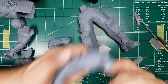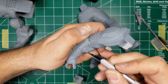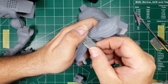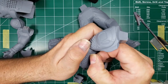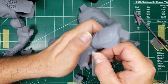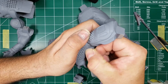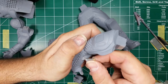The primer will act as a guide. Right now I'm scraping — you can see a line where there's white and gray, that's where the miss mold is. I'll scrape it until it all turns white, then go in with some sandpaper and clean it up. This is 600 grit sandpaper — I normally would use 400 or 320, but I'm out of that, so I'm using 600, which is a little slower and clogs up pretty easily. I don't have a whole lot of sanding so I'll stick with it.